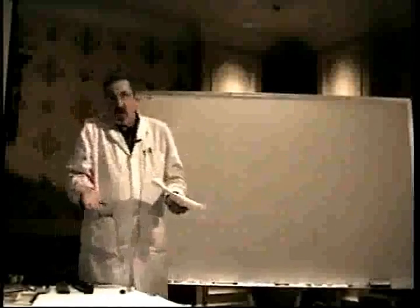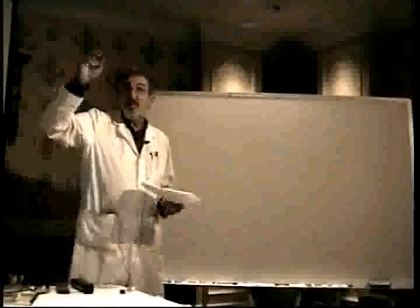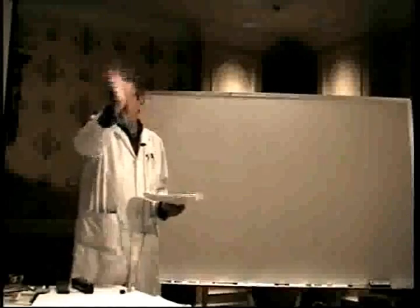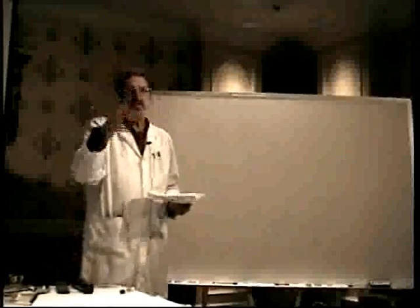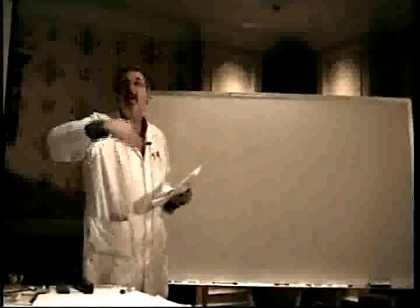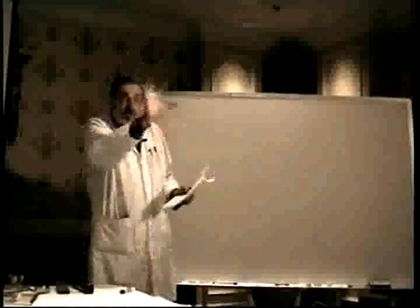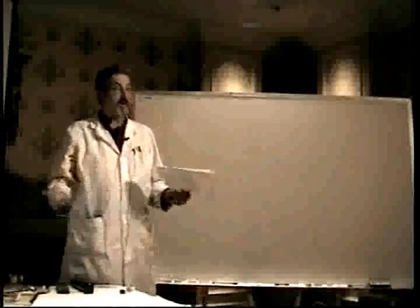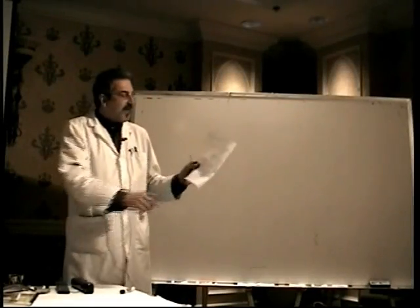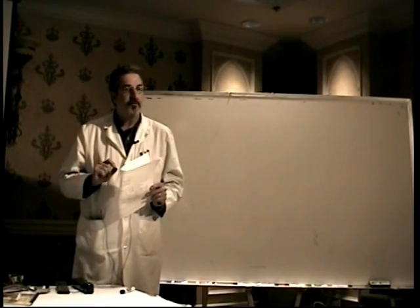That power supply that I just talked about, that 5-volt power supply, powers that whole integrated circuit, which, as you saw, is both the vertical and the horizontal sync together. Why is it that it just makes the horizontal sync go bad? If the power supply is bad to both of them, why is it not rolling vertically? Remember, that's the symptom of bad vertical sync. The picture rolls vertically one way or the other. Horizontal sync is the scramble weirdness. Why doesn't it affect the vertical as well? And the reason it doesn't is real interesting, and I mentioned it to you before. The power supply is synchronized to the flyback transformer.